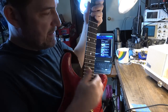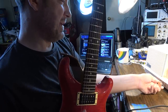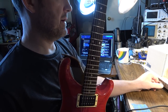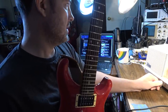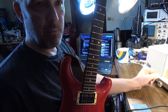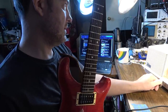Okay, trying this thing with a guitar, it's not going to sound good for sure. Got a lot of low-end hum. And I think that's just down to the fact that by the time they made this, they already had the RIAA standard, which is a standard of shaping the tone so that it works with the output of phono records or turntables of the time. Just basically the way that LPs and 45s or whatever records they had at the time were mastered so that they would be more universal, because before that, every record label basically had their own standard, and this was a way of making all the standards kind of universal, and they would match the amplifiers to that standard. And probably what's going on here is that we just got a problem with that.